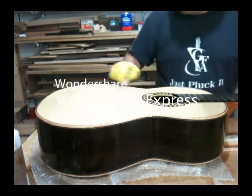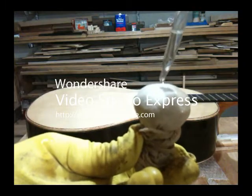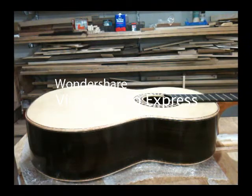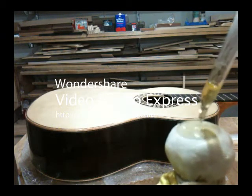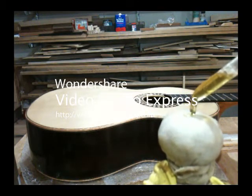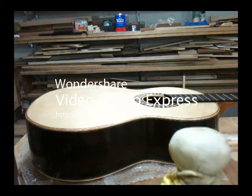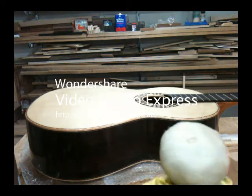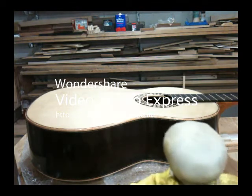In this case we're polishing the finish, but the same principle applies. After doing the whole surface with strictly the alcohol mixture to polish it, the next step is basically doing the same thing, but this time in addition to alcohol we'll have the shellac. At this stage in the process I'm using about equal amounts of shellac and alcohol — earlier I would have had more shellac and later I'll have more alcohol. In addition to the alcohol and the shellac, I also use a couple of drops of oil. I use walnut oil; some people use olive oil — either one works well. I like to let the oil absorb into the pad because you don't want the pad to be wet. It takes a few seconds for it to disappear, but all of a sudden it will just disappear into the pad, and then you're ready to go.